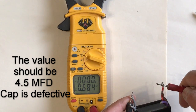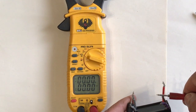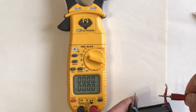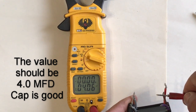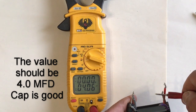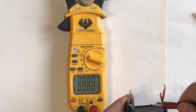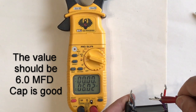So most likely that's our problem. We'll check the other caps. The next one is the brown wire. It takes a second or two to register because we're basically charging the cap using the meter's battery. In this case it reads 4.06 microfarad, which is pretty well in line with what we'd expect — it should be 4. And then the purple one shows 6 microfarad.